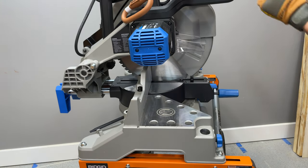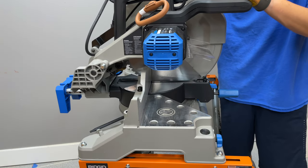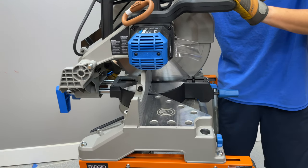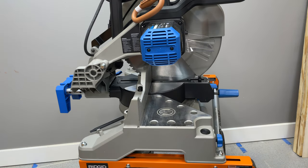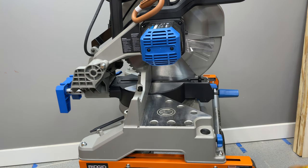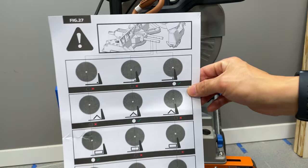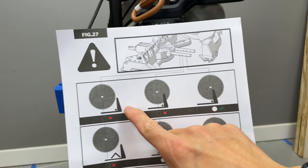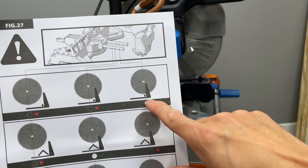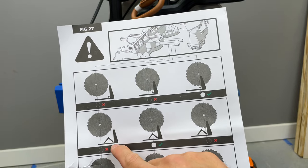The rail system lets you move the head of the saw. There are three positive stops on the rails. What really helps is that there's a best blade-to-fence position for each material type. An instruction sheet comes with the saw telling you exactly where to position the head — for a small piece of material you want the arbor vertically aligned with it for maximum blade life, best cut, and probably reduced kickback.